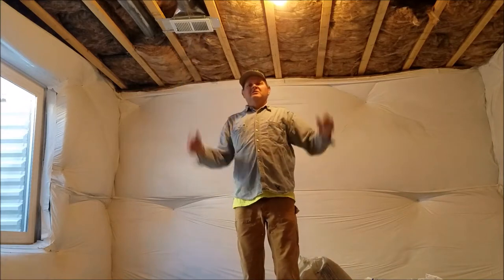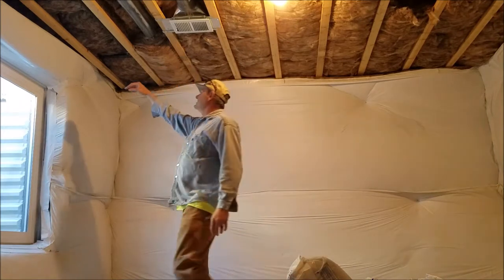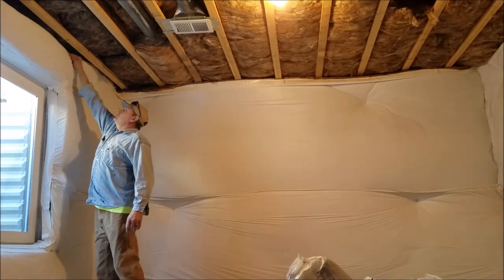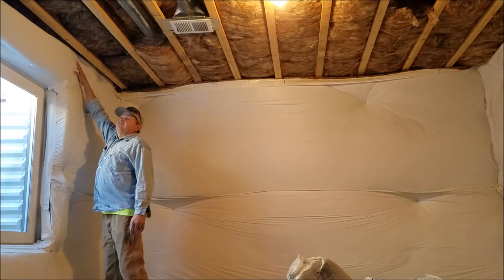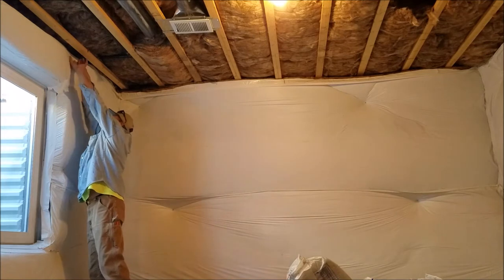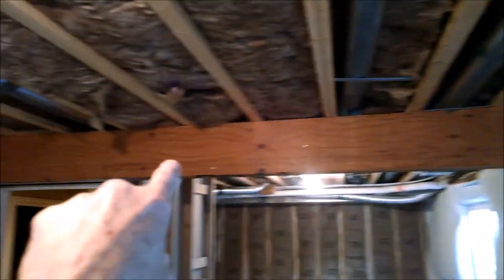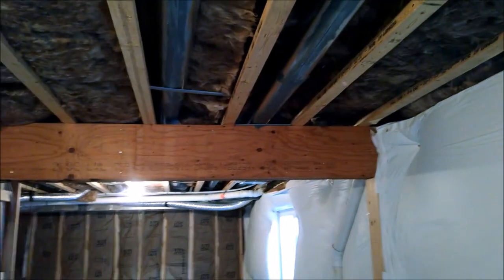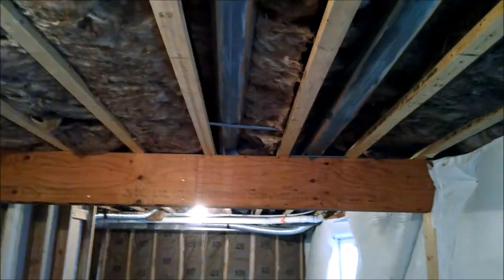We got all the R30 up in the ceiling now. We're getting ready to run our RC channel before we frame the walls. The reason is I don't want to run kickers this way with pieces of track or cut-off pieces of stud. I'm going to run the RC past so I can attach the track to it. I'm going to start at this beam — hopefully it's plumb, level, and square — and I'll pull off every two feet in this direction.